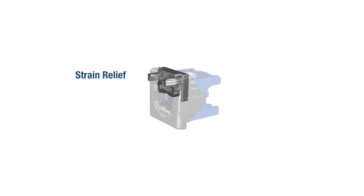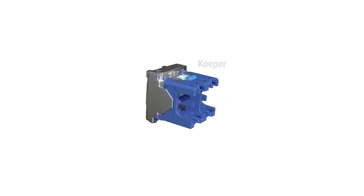The strain relief is located on the end of the wire cap that slides onto the cable jacket. The strain relief depresses onto the cable jacket to hold the wire cap firmly onto the cable, preventing any movement that could negatively impact the connection. The other side of the wire cap is known as the castle. Inside the castle are two posts that separate the conductor pairs when terminating cable end 2. The keeper is a small cavity on top of the wire cap that connects the wire cap to the jack module.